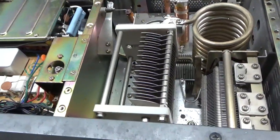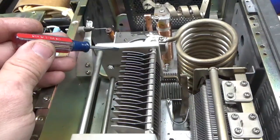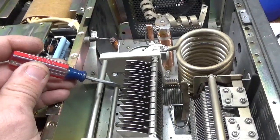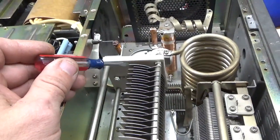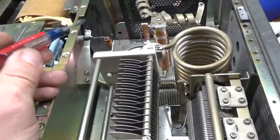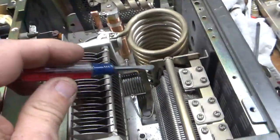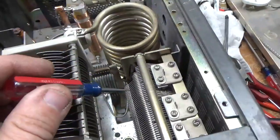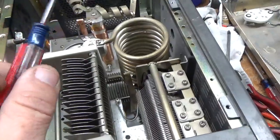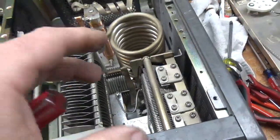Back with the top. You always want a picture of the air variable capacitor on the plate tuned side, because if there's damage it'll be on the edge here. People have tried filing it, but it will just end up promoting a flash at a lower voltage than what it's rated for. The load air variable capacitor is very difficult to damage — I think I've only changed one. But the capacitor that came in on this amplifier was actually scraping, so it was shorting.